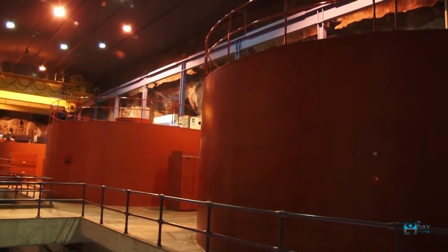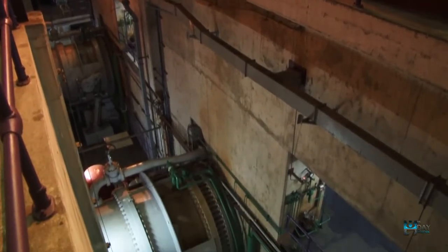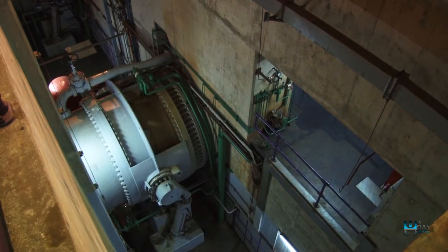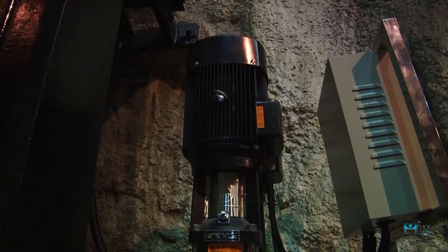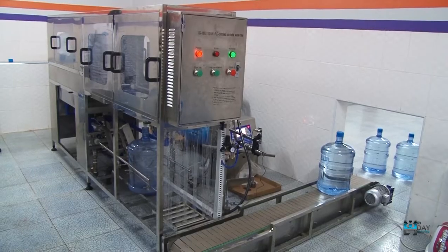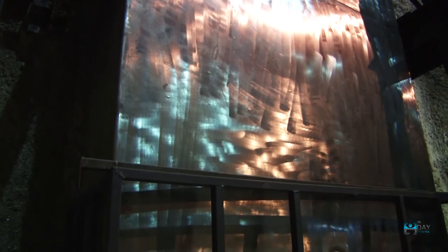At the powerhouse, the collection tank is served by two high pressure pumps — one in normal operation is duty, the other one is standby. These pumps convey this water from the powerhouse to the bottling plant at a distance of 1 kilometre and an elevation of 145 metres.